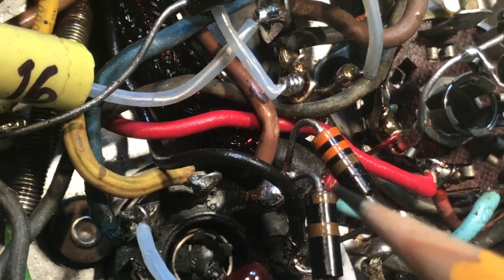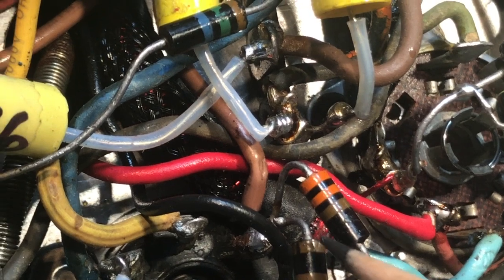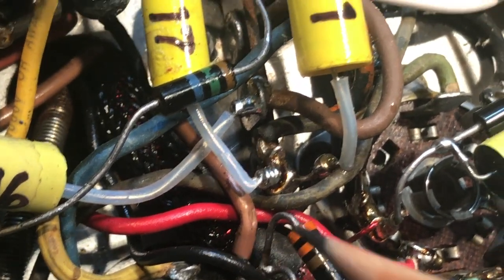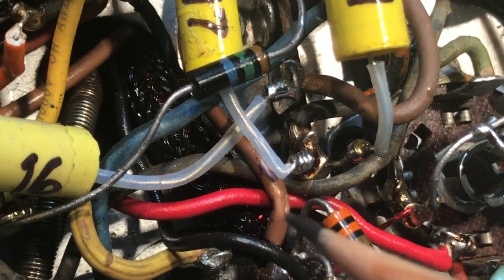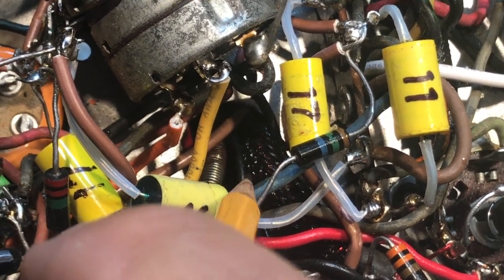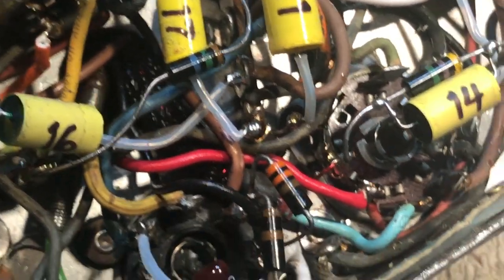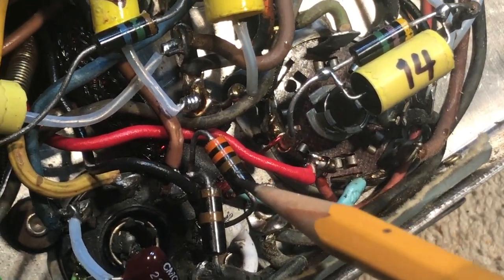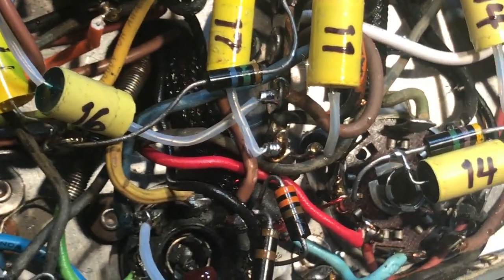What I had to do, since it looks red, I used 22 gauge solid enameled wire and coiled it up on a small screwdriver to make a spring out of it, and used some of my go-to glue across two sides of it to hold them all together, and then sleeved it in a jacket of that braiding you can see right through there. And put the IF, remounted the IF can, and then slid this wire into it and worked it all the way back in and into the IF can.